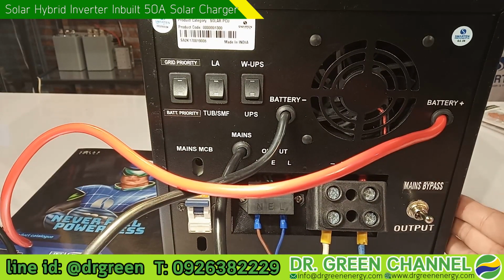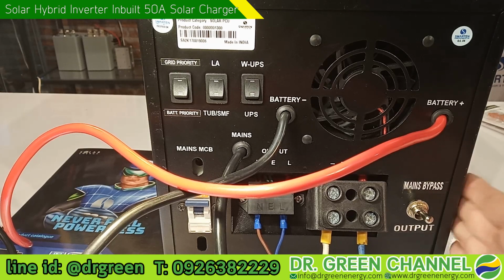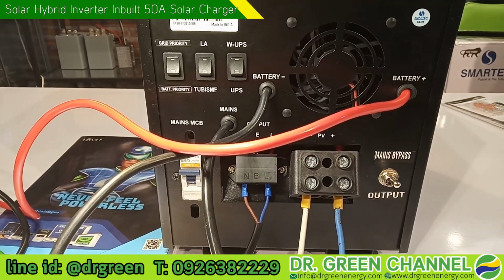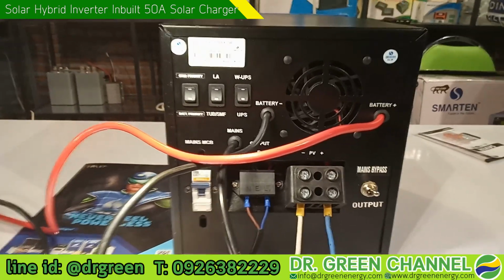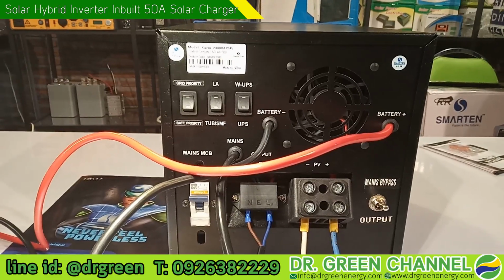So as a principle, for the bypass, it will just connect the power from the grid to supply to the load directly. So don't pass anything inside this inverter. So this is very good and very safe design in the case of this inverter or the solar hybrid inverter having problem sometimes. So you just put the switch into the bypass position.